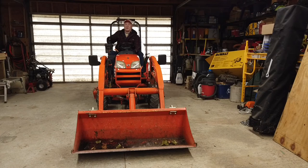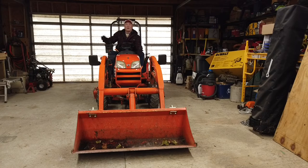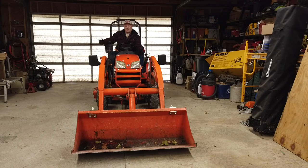And that's it — taking it off. A little bit later I'll go into how I put the front end loader back on the tractor. One of the biggest things you can do is do this on a level surface — it makes it a whole lot easier. I find that when I remove the front end loader and the tractor is higher or lower than the front end loader, or a little tipped to one side, it's a lot more difficult. So I'll try to videotape putting the loader back on. I'm going to go cut my leaves up and blow them away.